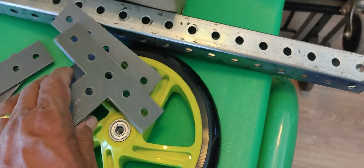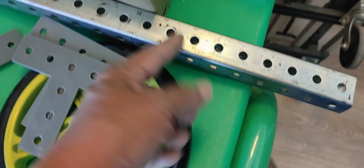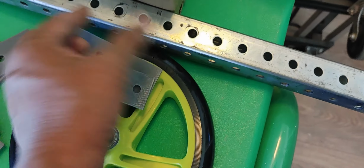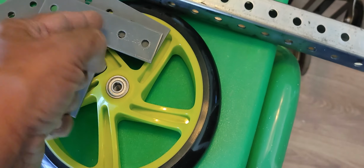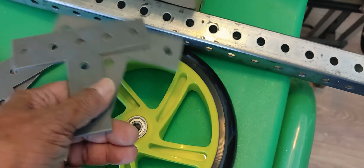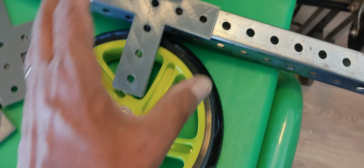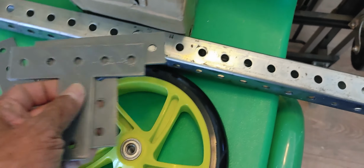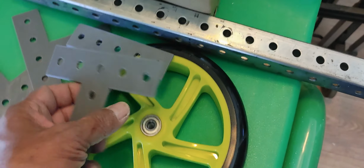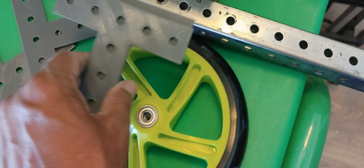I mean, I don't even need to send the brackets. This is just 1 inch on center, and all you need is the width of the tubing and the number of holes that you want, horizontal and vertical, and you have your bracket. But I did these, just for my sake as well, to make a mock-up with this. Of course, you can't use this. You could use these reinforced with a plate, but what's the point in doing a metal plate and sandwiching it in between these two?